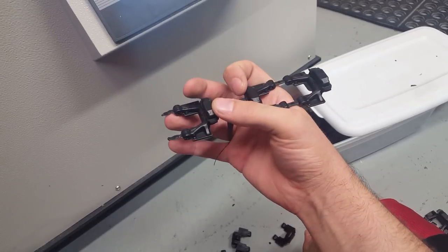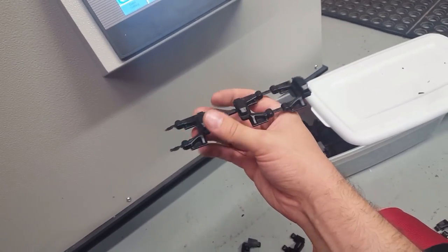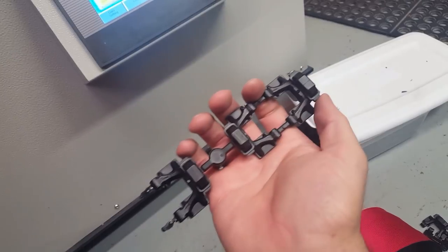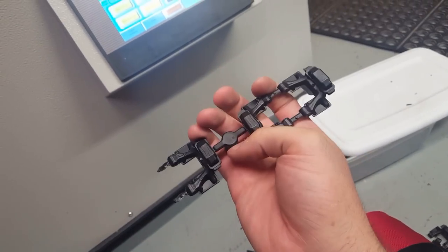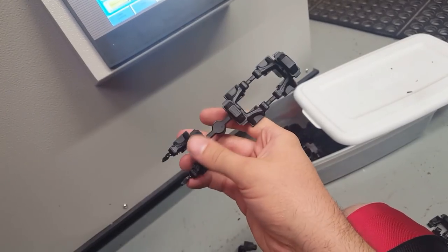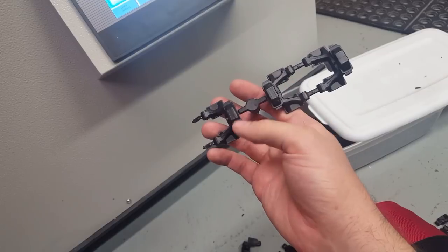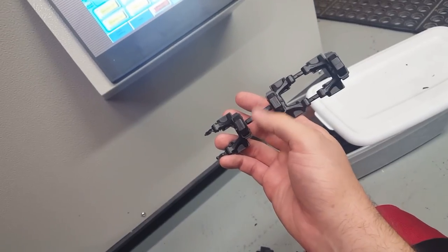And then some of the plastic squeezed in between that patch I put on the mold to block off the other fourth link. And you'll notice the end one, the trackpad, is actually nicer looking than the other two. That's because the way Delrin works is it needs to be packed, is what they call it. So I kind of screwed up the whole mold's flow by sealing off this fourth channel. I might go through and seal off this link, because that way it's symmetrical. The reason they don't look the same is it's not symmetrical right now.